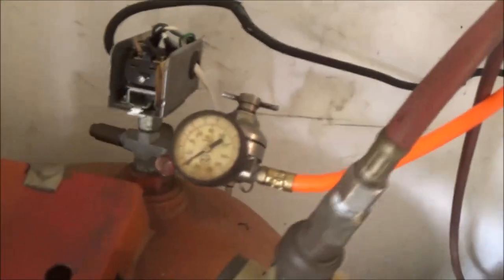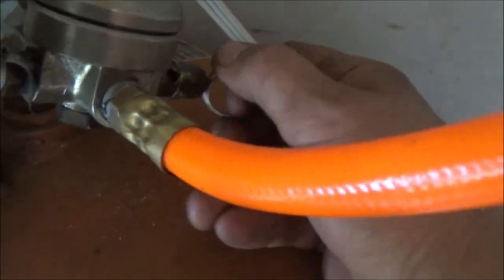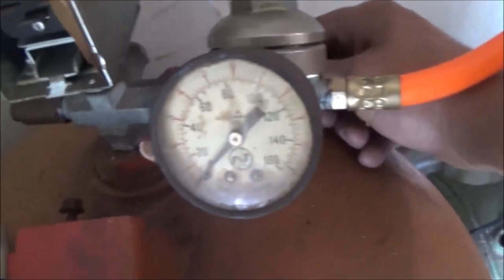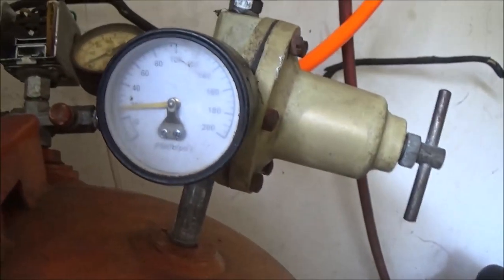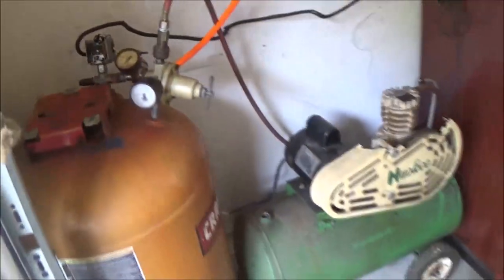It's been running about a minute and a half. I want to show you this slider valve — right now it's off, nothing's coming out of the pop-off. If I push it that way it opens up, and if I shut it off it just drains what's in the hose. It's already starting to build up some air pressure — we're already up to 20 pounds. I'm going to see if I can get it up to around 100 psi; I think that'll be plenty.